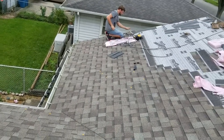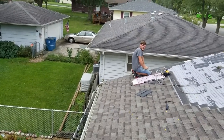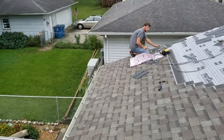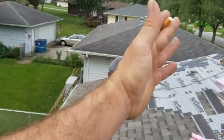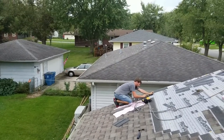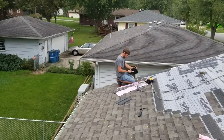You could have used a full shingle or anything that works. If you left that shingle as the stair step right there it leaves you a long enough finisher — that little piece is not going to blow off, you can use whatever makes the cut. Whatever makes the distance, use those as you go up for the next one — that way you don't have to use full shingles. Then on your next run over you end up having to use full shingles so you can use the square end to butt it and get straight again. I think this boy's taken to it.